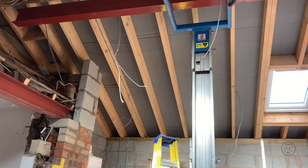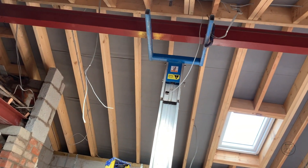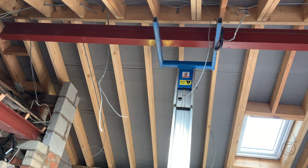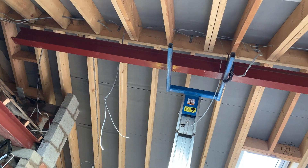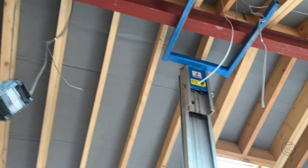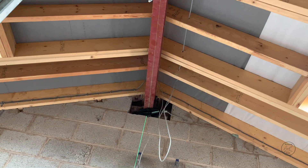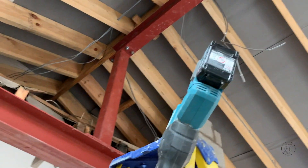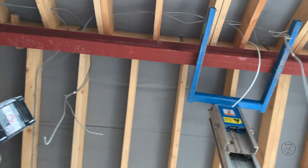Just got to watch that clamp at the top - it's actually got to go in there now. Watch the clamp at the top - that clamp's going to hit the ridge and then we won't move it, so I'll have to get that off. Let me sort that now. We can see the laser line there - we're parallel with the roof, it's in line. The laser's telling us they're in line now and plumb off the laser. So we're just going to check if this is level across there.